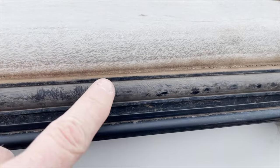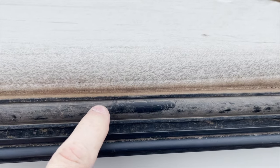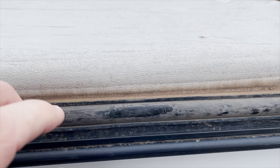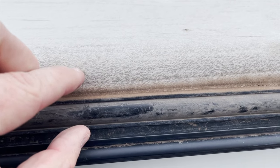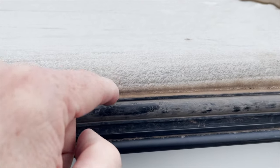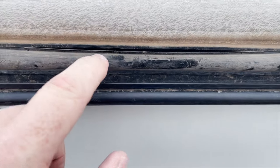You can check your insert molding a couple of ways: it's very dirty — you can see the dirt I'm wiping off — and hear how I'm able to tap it and it's loose. This molding is designed to fit in that track and expand with a wing that deflects water. If it's shrunk up enough, water will get past it and cause damage.